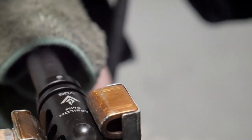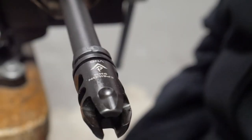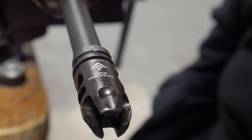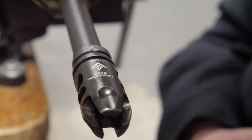We're going to go ahead and start the weld — push it down with a couple small circles, make sure it's all good and well. Turn the gas off and the TIG welder off when done. It kind of feels like being a Power Ranger with this welding mask on. Once you use a dirty shop rag with some oil it actually brings the color back, so you don't even need to cold blue or oxide the muzzle brake — you're pretty much all set from here.